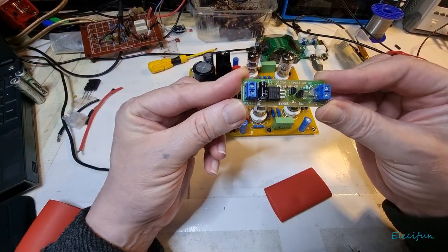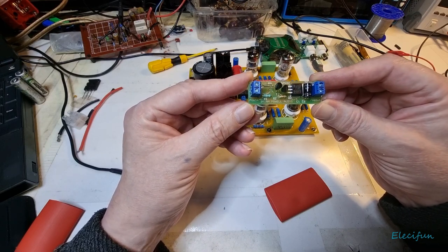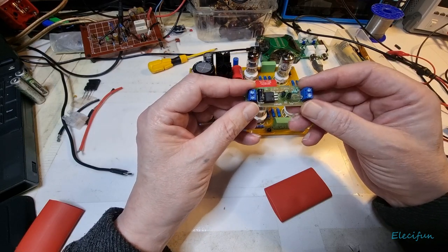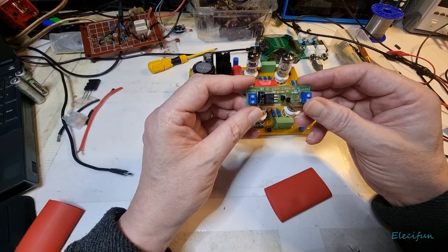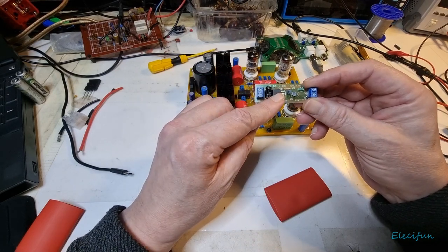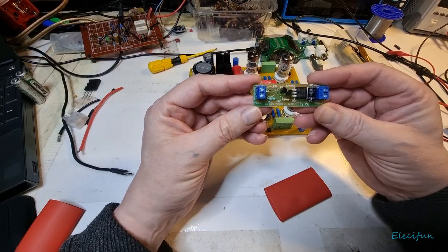What I've decided to do is employ some bits of kit like this. This is a speaker protector, and unlike some of the other speaker protectors I was looking at, this one doesn't require its own voltage — it works on its own. These are the threshold voltages. If DC were to come through, it looks out for DC: this capacitor will charge up when there's a DC state going on, and that will cause these two transistors to act like a diac, which in turn will turn on the triac — and that will then short out the connection to the speakers.